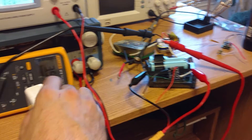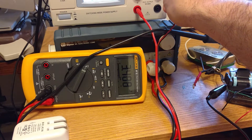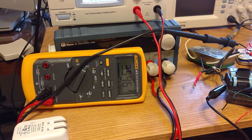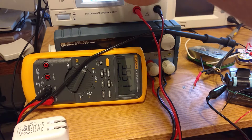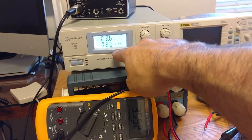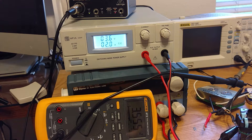Just to show you — I have a Fluke right here. I unplug it and battery voltage drops a little bit. Plug it back in and battery voltage rises. As it puts that energy back into the batteries, the voltage rises until it reaches its 4.2-volt limit. As it gets closer to that limit, this current is going to ramp down. I can show you that in an accelerated manner by putting in a battery which is less discharged.